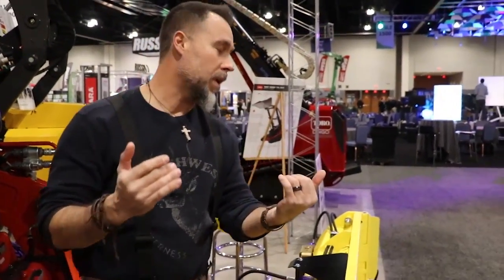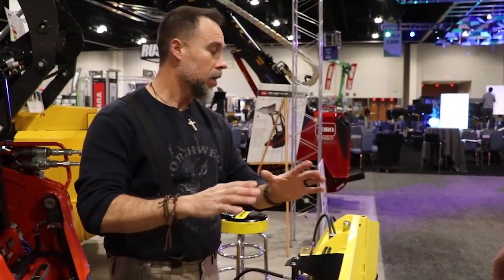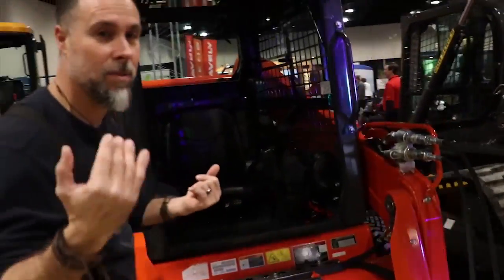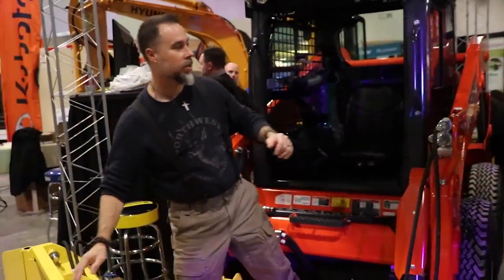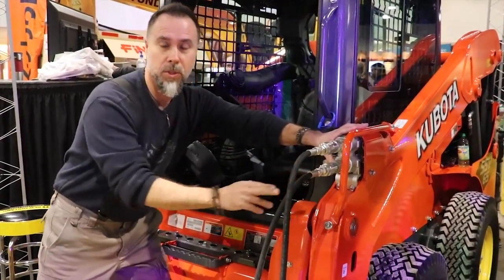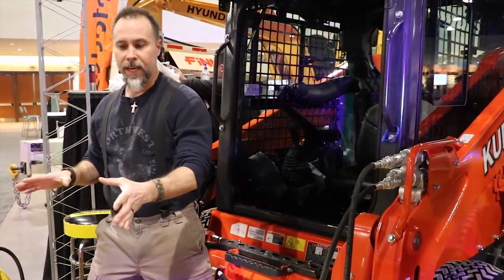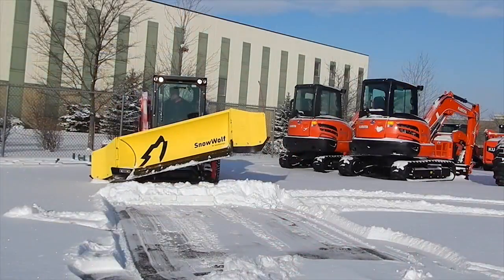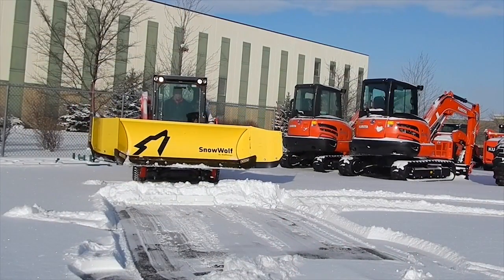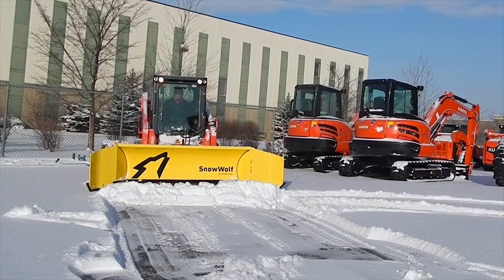For you guys that don't know about Quattro plows, this is a 2-connection system. Come on over here. I kind of jumped the gun. I automatically assumed everybody knew about Quattro plows. They don't. This entire plow system hooks up right here. 2 hydraulic connections. And what that does is that allows the plow to come up, these wings to move forward with no electrical connections, no other controls needed at all in the cab, none.